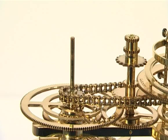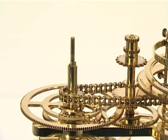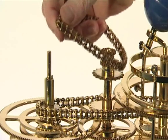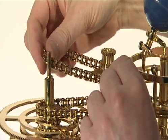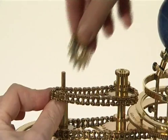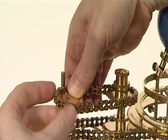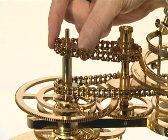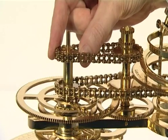The second phase of stage 7 adds the short chain and sprocket supplied with issues 47 and 48. Begin by sliding the long brass spacer on the top of the 14-tooth sprocket and engaging its jaws. Wrap the short chain around the 18-tooth sprocket towards the top of the central shaft and pull it taut. Wrap the free end of the short chain around the remaining 14-tooth sprocket, place the sprocket onto the central drive shaft, and engage its jaws with those on the top of the long spacer.